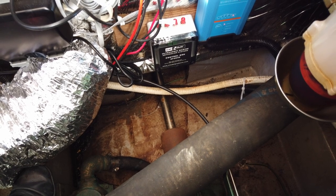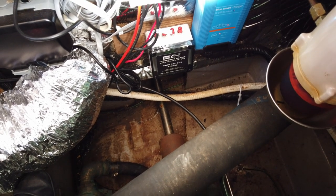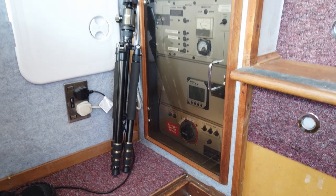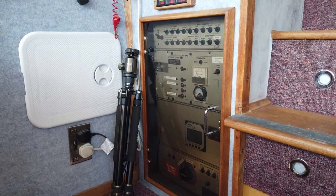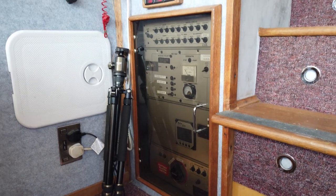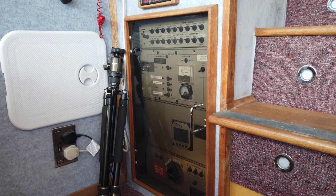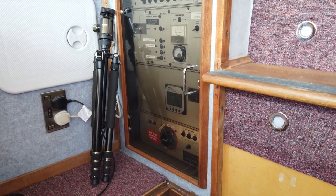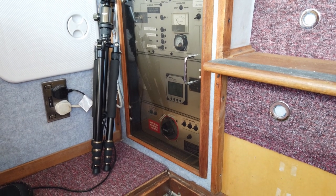Anyway, that's in, so now I can determine how much cable I need in order to power that up. And we'll take the power from the back of our main power supply, so the top supplies are all 12 volts. I'll find a permanent 12 volt supply. We'll put a switch into that and then a 5 amp fuse between that and the controller.